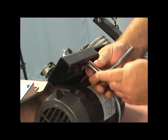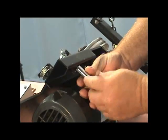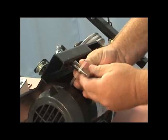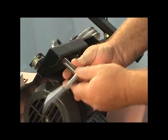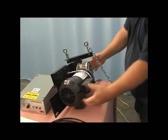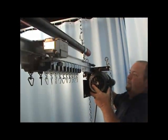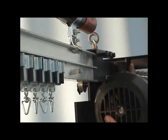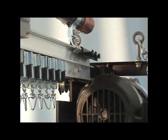In preparation for attaching the machine to the track, loosen the bolts of the machine mounting bracket but do not remove them. Next, lift the machine into position, sliding it onto the track. Secure it to the track by tightening the bracket mounting bolts. Attach the support chains or ceiling brackets to the overhead structural support.